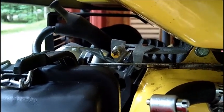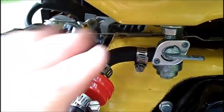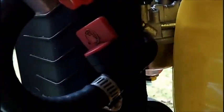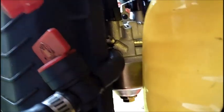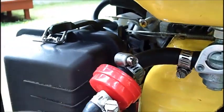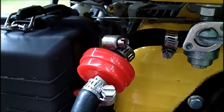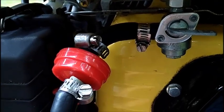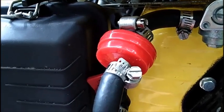Anyways, it's all set — this is the best I can do with this arrangement, and this is what's been taking up so much time. You can see it goes around here; in the back it's not leaking. But if I keep playing with this thing — loosening the clamps, twisting the hose, tightening them up — the damn things are going to leak. And if it leaks on this end, the generator is toward the back of the gen house; I could have gas all over the place and not know it until the whole thing burns up. So I'm leaving it alone.